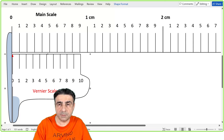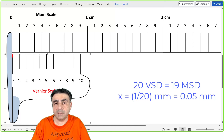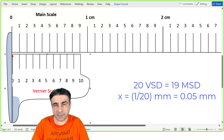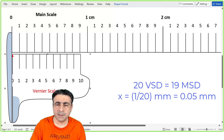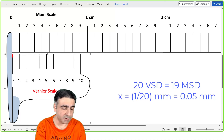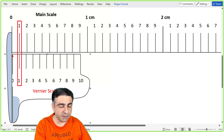If I had more divisions — say m = 20, so 20 Vernier divisions coincide with 19 main scale divisions — x would be 1/20 mm. If I slide the Vernier scale out by 2x so that Vernier division number two coincides with a main scale division, then the gap between jaws is 2x = 0.2 mm. Each time you see which Vernier scale division coincides with a main scale division, that tells you the fractional extra distance beyond the last main scale mark.